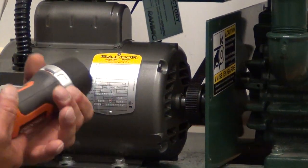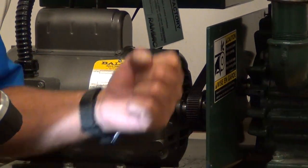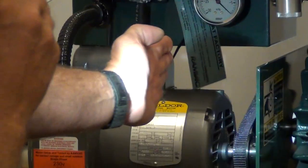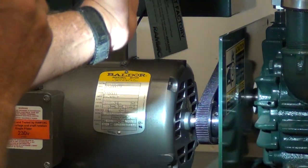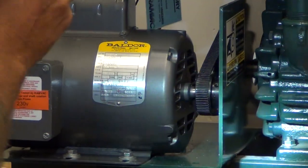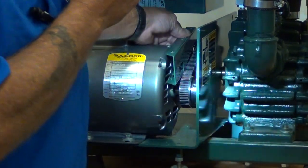The items you want to check on the belt are, with a flashlight: check for fraying, check for dusting. By dusting, I mean pulverized pieces of the belt on the side of the housing will look like powder. You also want to check your gear and pulley alignment. Stand at a relatively good angle, sight it with your eyes, and make sure it's tracking straight from the motor pulley to the turbine pulley. This one's tracking pretty straight. If you do have a problem eyeballing it, you can use anything that gives you a straight edge — part of the belt guard — and that can help you get a better perspective on it.